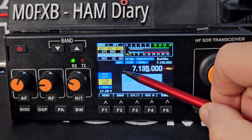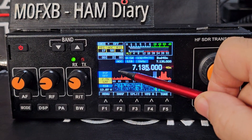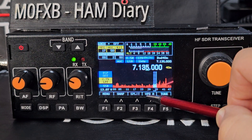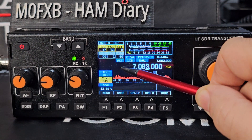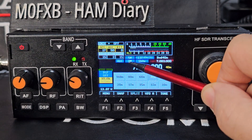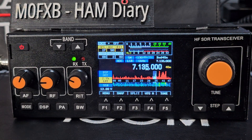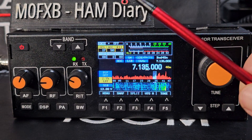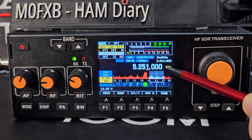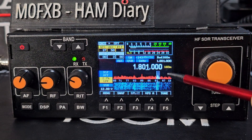Tap the screen to go back to 40 meters. Tapping different areas of the screen brings up different views — tapping brought up the scope, tapping elsewhere brought the dual view. On screen you've got AGC selection, LSB, and power all adjustable. To calibrate the touchscreen, turn it off, hold your stylus on the screen, then turn it back on. You can also change bands by tapping in the right place — it tells you the band, including 160 meters and even 4 meters.